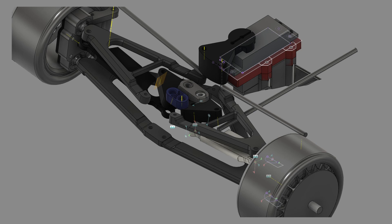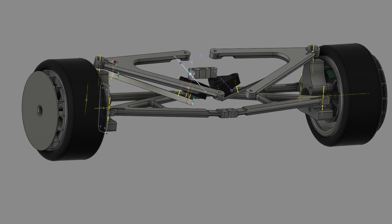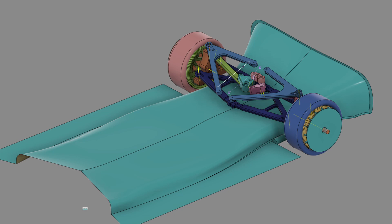It was a major amount of work — I basically redesigned the entire front suspension and the whole monocoque around it, but it's very noticeable when actually driving the car. As mentioned in the last video, the cantilevered rear suspension that allowed for the massive diffuser was a bit too aggressive and caused some weird wheel hop issues. I lowered the lower control arm mounting points by 4 millimeters, which meant lowering the venturi tunnels under the car by 4 millimeters as well. Oddly, downforce actually increased because the diffuser is being driven harder and the vortices are a little stronger, though height sensitivity will have increased somewhat, but hopefully that can be tuned out with the improved suspension geometry.